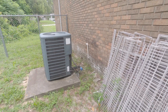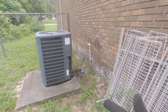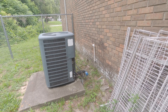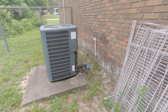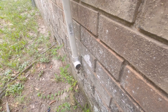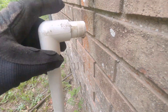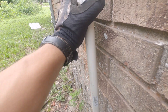I'm not satisfied with just doing one unit, so I like to do a walkthrough of the building. We've got a walk-in cooler condensing unit here — actually it's a reach-in cooler, not a walk-in. You can see the drain line on this one here is just as bad if not worse. Pretty nasty — got some nasty stuff in there. I'm gonna advise him about this as well.